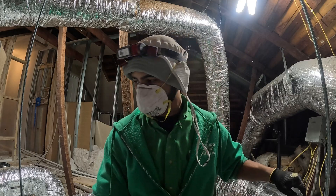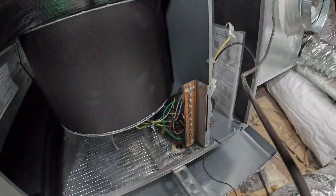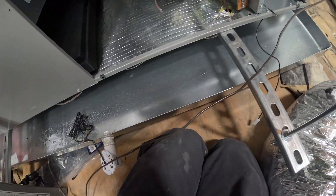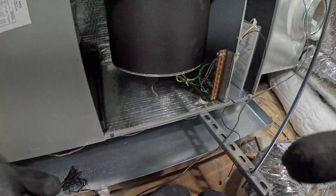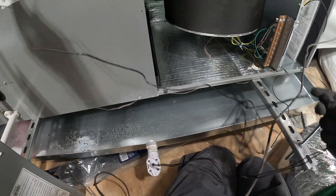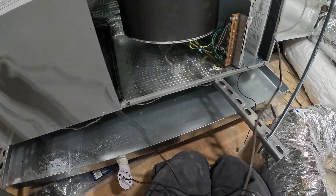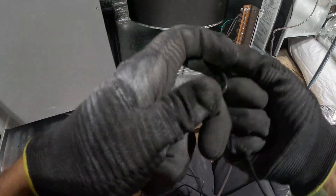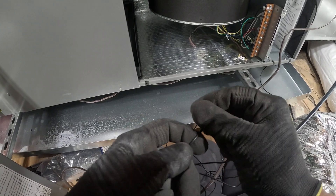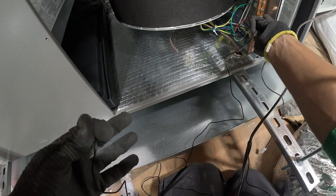Take this off right here and find your wiring. This is pretty simple with this one — we have our connections right there, screws. We have our overflow switch right here. With this overflow switch, you only have two wires. Remember, it's not a load, it's a switch. You just want to make sure — sometimes people connect this like it's a load with R in common. But you just want to put one side of R on here from the thermostat.